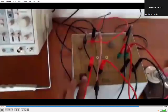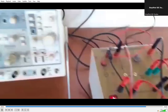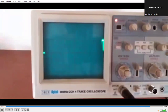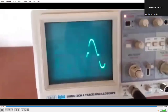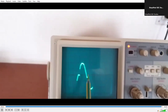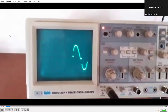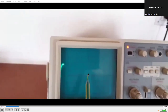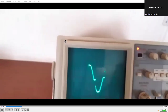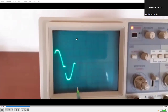Just observe. The CRO is mainly used for observing the output voltage. Now we are going to vary the firing angle. With respect to changes in firing angle, the brightness of the lamp is getting varied — you can also observe the waveforms. The device turns on at a firing angle of alpha. The total number of divisions I measured is 1.6; I consider only the half cycle. Please measure the horizontal distance on the CRO. The number of divisions is 0.4, so the firing angle = 0.4 / 1.6 × 180 degrees.